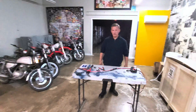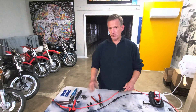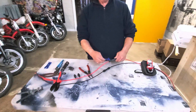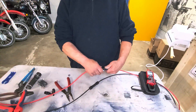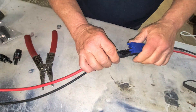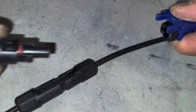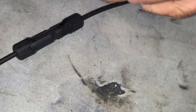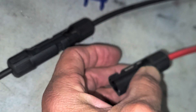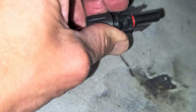If you're trying to get something going, you pull apart your MC4 connectors using the solar disconnection tool. We'll do slow motion to show right where this goes. See the tapered part? You want to put those things right on the taper — like that — and pull it apart. Right on this groove, these clips go through there and hook on the edge, so you've got to release them.